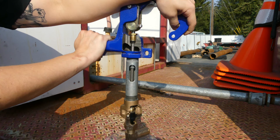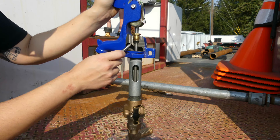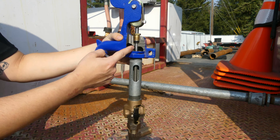We'll open this once again so you can see that there's a rod here that travels up and down, which controls that plug or stopper. This rod is sealed with a double o-ring and a compression fitting here. This just holds those o-rings in place and prevents water from being able to pass up through this section of the frost-free hydrant.